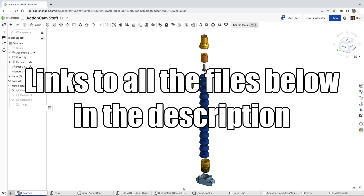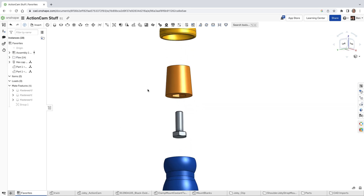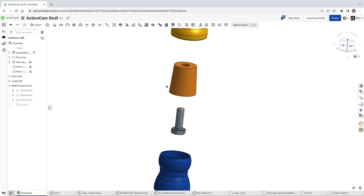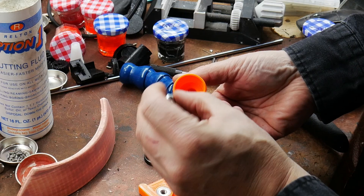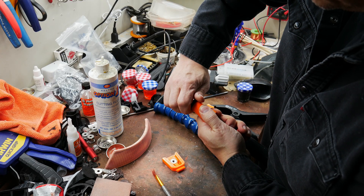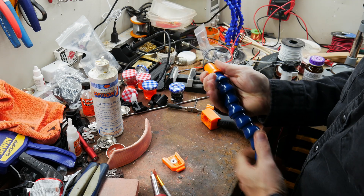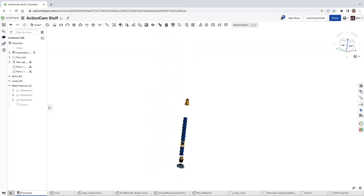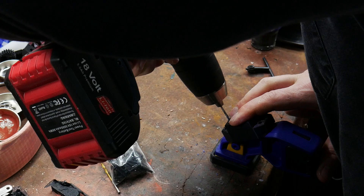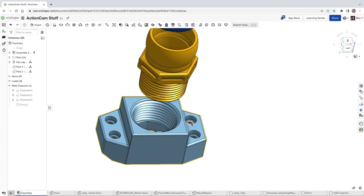Here's all the pieces. One piece I didn't show you how to model — honestly, it's a circle with a hole in it and it's got a taper. That taper matches the end nozzle of the Lockline that shoots right up into the center. A bolt comes up into that piece, and that piece goes right up into the end of the Lockline. This is where you attach your cold shoe for your camera. This piece will snap onto the Lockline whatever length you have, and that snaps onto the screw-on mount. You mount this onto the clamp and use these as guide holes to drill and then tap.